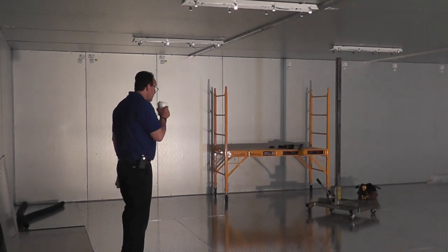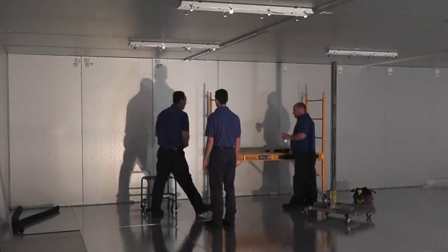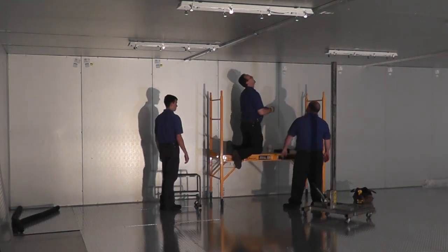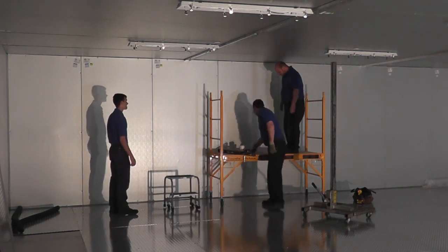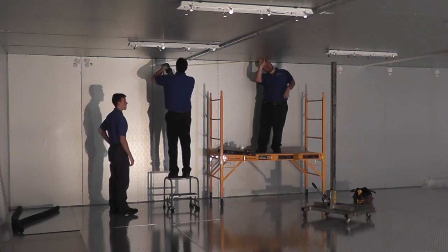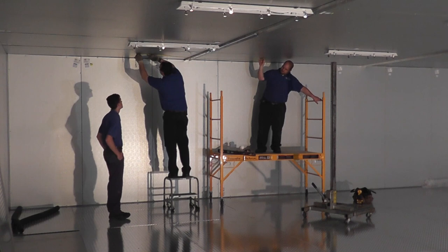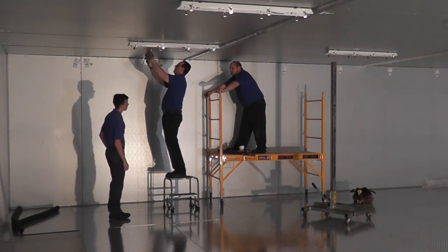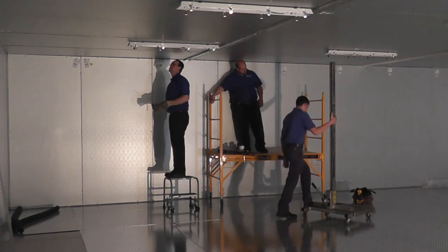So after coffee time is pretty much just time to hang the evaporators. Not too hard to do, just measure where you want them to be and drill the hole straight up. Since these evaporators aren't that heavy, and they are going to be spanning the actual support tracks, we didn't need to bring them all the way up with threaded rod to the girders.